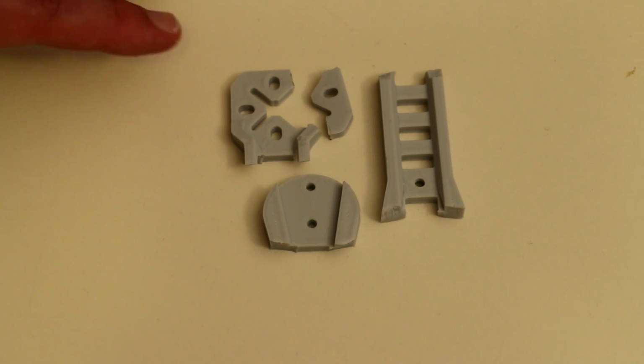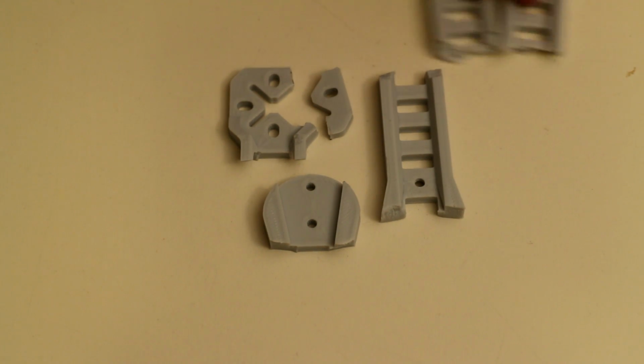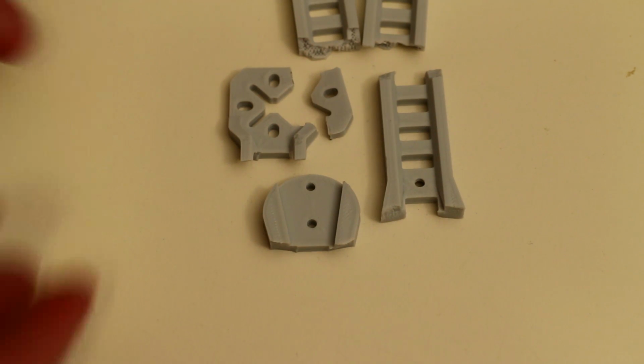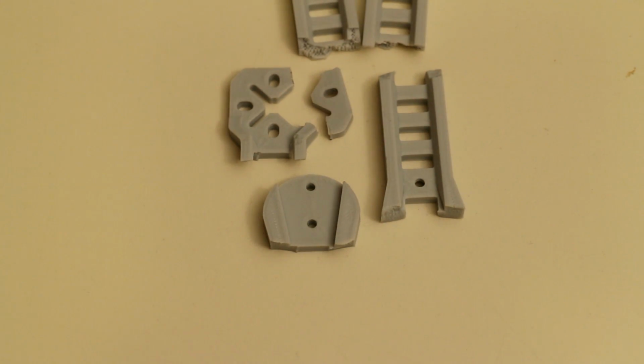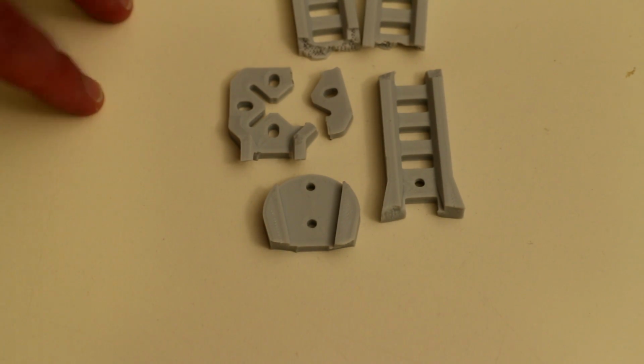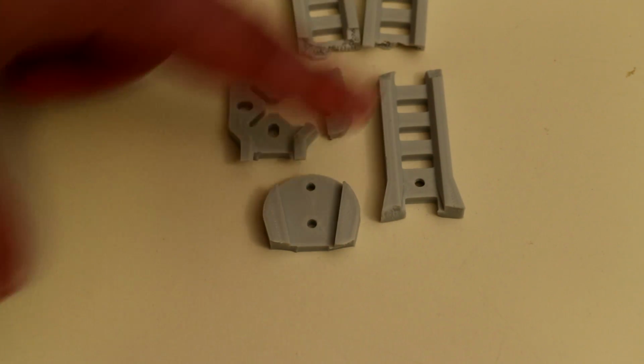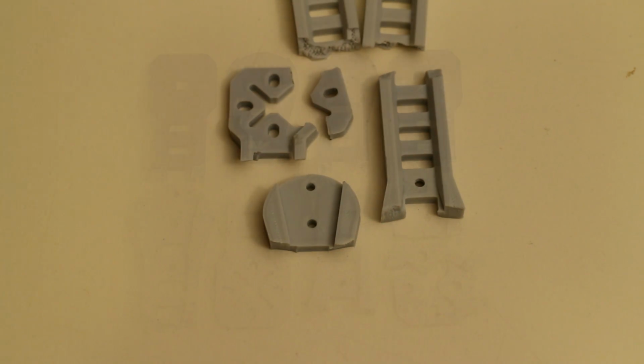But unlike polycarbonate, this PLA material has a glass transition temperature of about 50 degrees Celsius, where polycarbonate is well over 100 degrees Celsius. So I guess it comes down to your use case. Now, for a quadcopter frame, rather than getting a force over time, which is what I've been doing here by slowly bending with hand tools, when the quad comes crashing down to earth or hitting a tree, it's an instant impact. So in this particular setup, I think ABS is still the preferred choice, as ABS will start to stress as opposed to PLA, which may just snap on an impact.